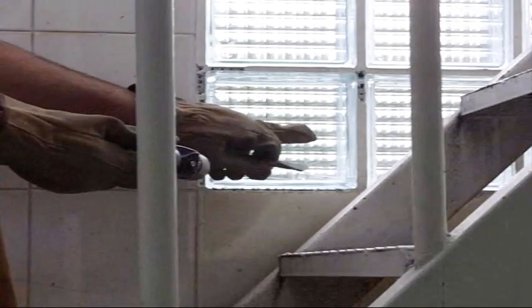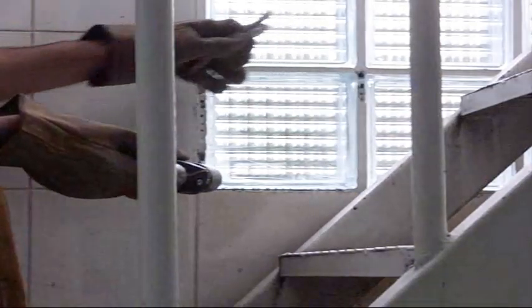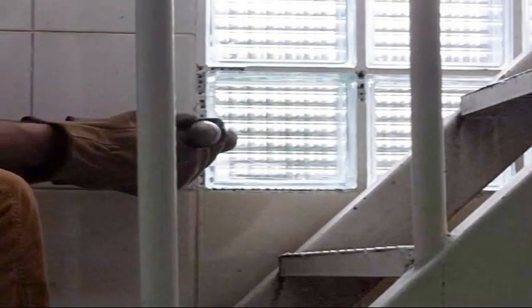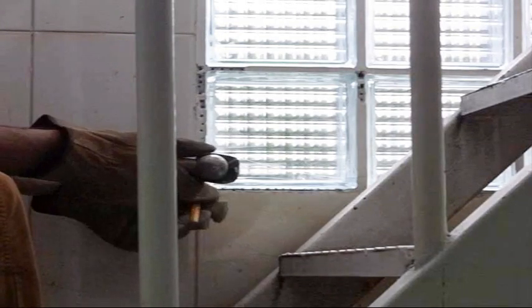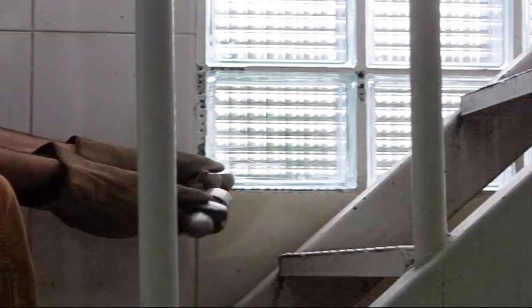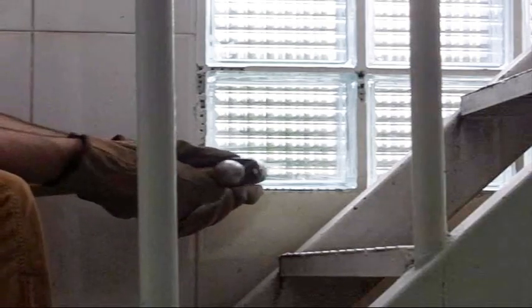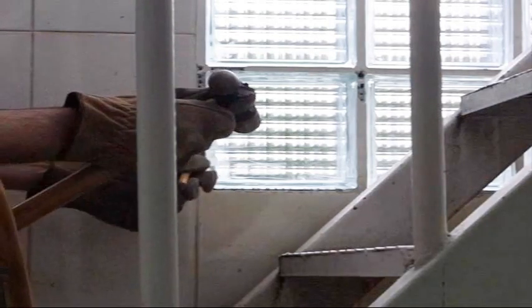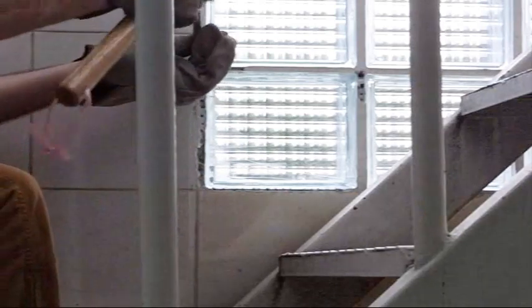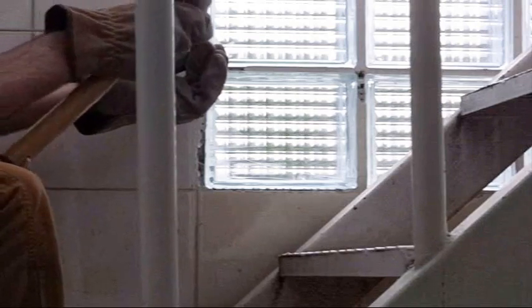When I break this block, that's going to be the strategy: when you crack glass it expands. I don't want to crack the surrounding blocks. I'll give it some buffer room so that when this block pops it won't take out the adjacent blocks. Down here it's going to have to work with less space, so I can't really chisel on it. Up here the gap is much bigger, so I just try to weaken it between the two holes.